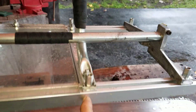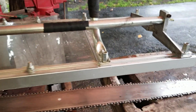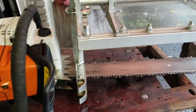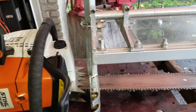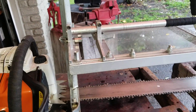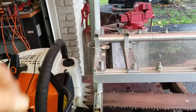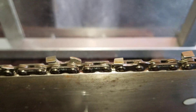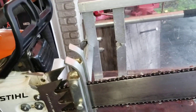This mini mill should work really good now that it's that much longer. It was a pain before because when you had the ladder, it would barely reach the end of the ladder and kept slipping off. So that's a 36-inch bar — a Husqvarna bar that I readjusted the end to fit the Stihl. I drilled an extra oil hole in it to line up a little better — it's got two oil holes and two adjuster holes, so no matter what saw you run it on it fits pretty good. This is that Lowepro chain made by Oregon — I made a ripping chain out of it and I stoned it. You can see where I stoned it: I put it in the vise, run it, and just hold the stone against it. So this chain should cut without any lines.